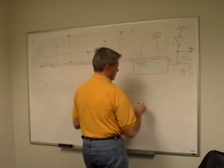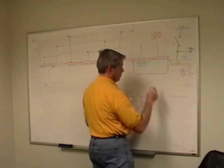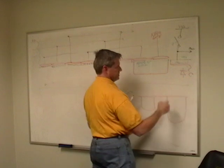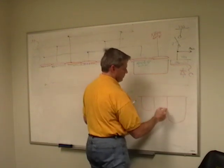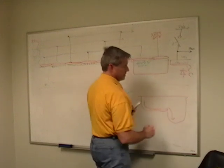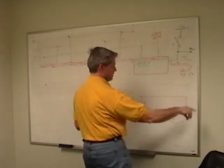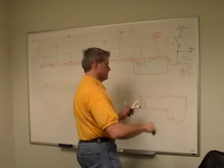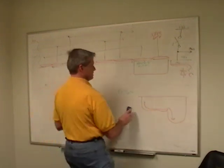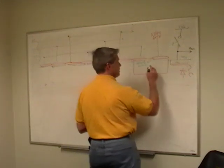And a way to look at this is if you look at charge levels, I created a hole. This guy over here is a permanent potential well that looks like that. So when I open this up, if I think about it as water, all my electrons flow down into there. It's going to a lower energy state for them. And when you start looking at band gap diagrams and things like this, you'll start seeing this kind of thing all over the place. It's a way to visualize and make sense of these things. So what just happened is all my electrons just went to there.